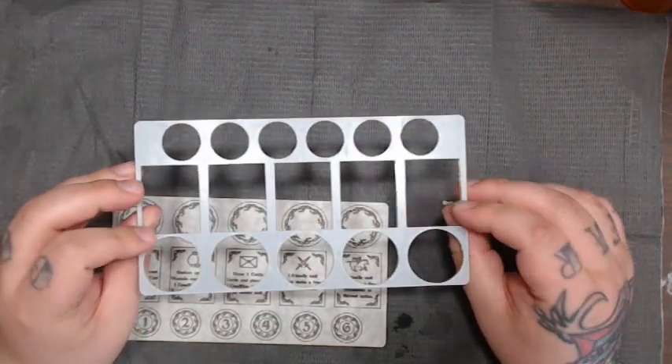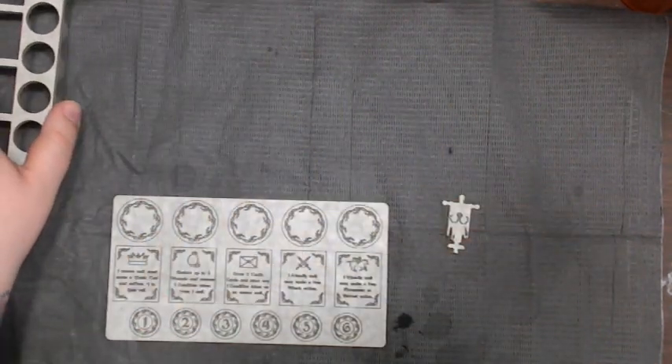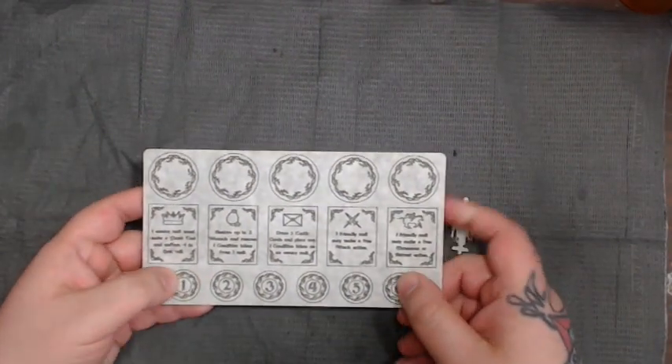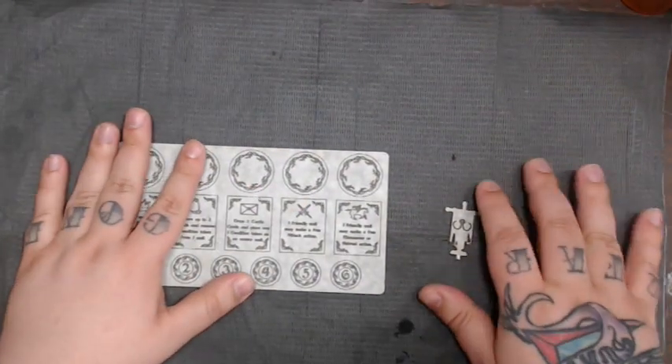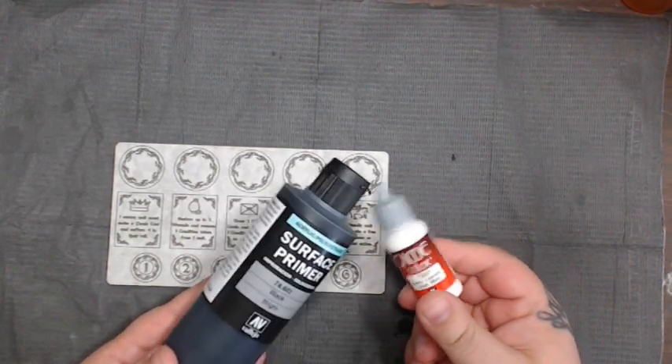The front and back have mask on them. The back side mask is a little bit more thick and durable, and the front side mask has a lot of properties that you would get out of masking tape. They just laser things into the acrylic through that mask. And since the actual acrylic's being exposed, you can use crayon or something to bring out that lettering. But we're going to use paint.